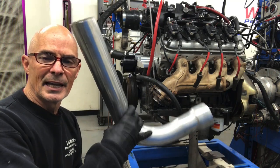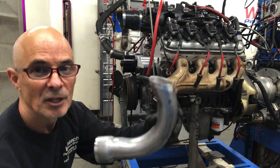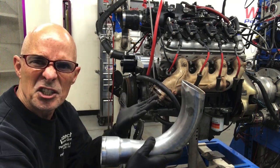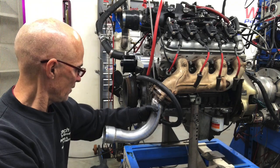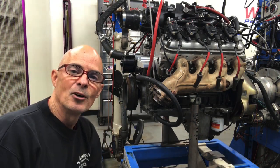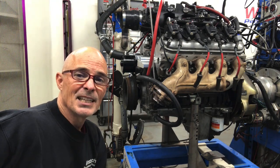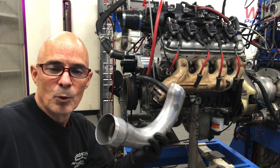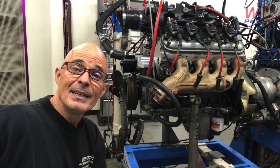I've taken my piece of tubing from the muffler shop and cut it down to a smaller size. The key thing to notice is this is an angle cut that's going to put this at the right angle - I want this kind of parallel with the ground. I just want to make sure the turbo is mounted correctly. So I can mount that like this and the other tube mounts to it. Notice this is going to go onto this at an angle - it's not ideal for flow, and there are better ways to do it if we had more bends. But you're not asking it to flow a whole bunch since we're doing a twin turbo setup, not a single. Running little GT35s on it, this will probably work. I'll probably redo this with better bends and nicer welding when I'm done. Let's get going and see if we can make our turbo kit.